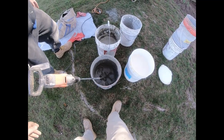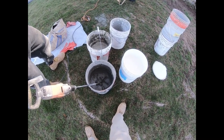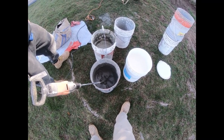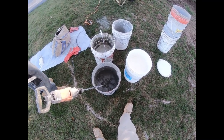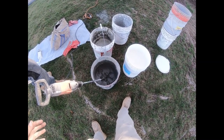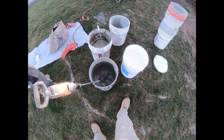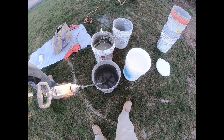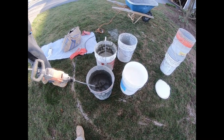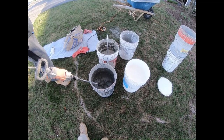As a tip: if it's any bit moderately warm outside, you drill mix this and let it sit for 10 minutes — it's going to tighten back up. Then you want to hit it with the drill again. Sometimes just a little splash of water in there brings it back to life. Usually it tightens up that first time and then you've got it going for a while. If it tightens up again, take it back to the drill, splash a little water in, and re-whip it.